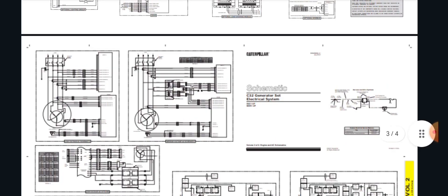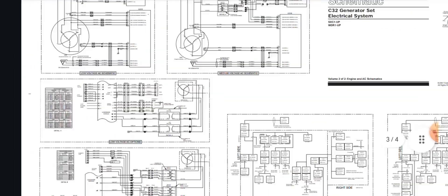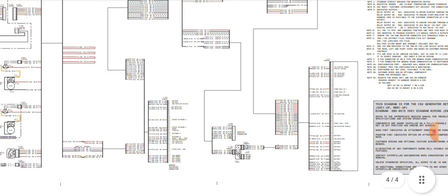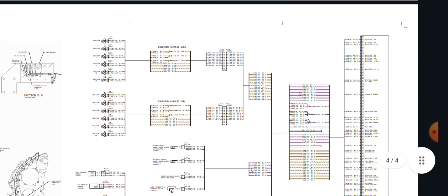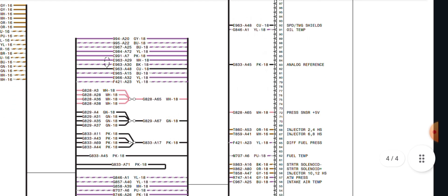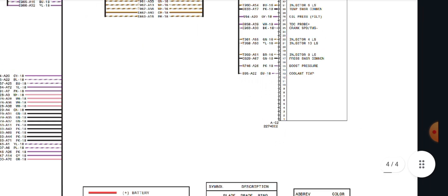As you can see, here is the complete block diagram of the alternator connections, AVR connections, and also the ACU connection, along with the complete wiring harness after the generator engine. We have this 120-pin connector. As you can see, injectors and also the speed timing shield, all temperature, analog reference, pressure sensors, injectors, fuel temperature, and starter solenoid — all the complete wiring diagram input and output connections.